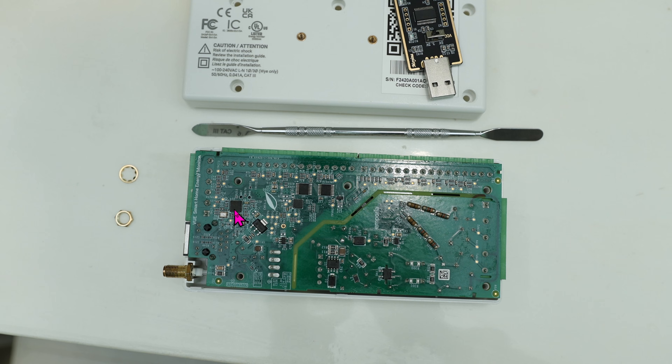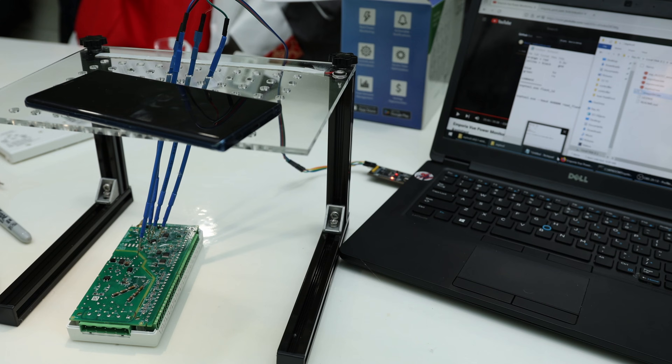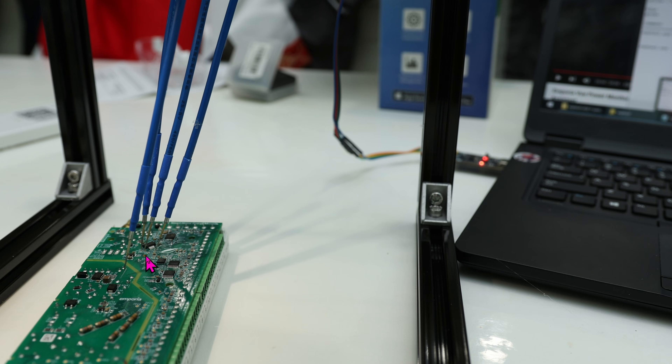In this photo of mine, the area of interest is on the left-hand side. Before flashing with our own custom firmware, I highly recommend backing up the original factory firmware. To do that, we only need four pins. The connections are crazy small — since I didn't want to solder anything, I used a BDM frame. Using these four blue probes, I connect them to the four pins on the board. Let's zoom in a little so you can see that the tips of the probes are actually touching the four pins.